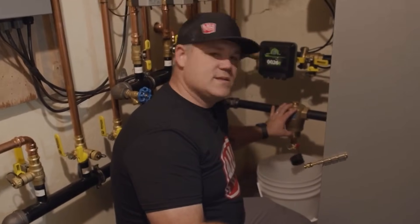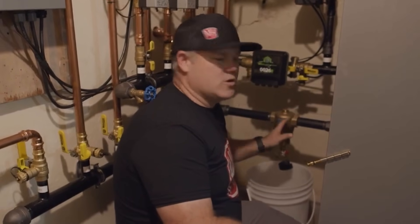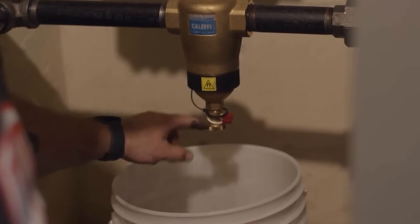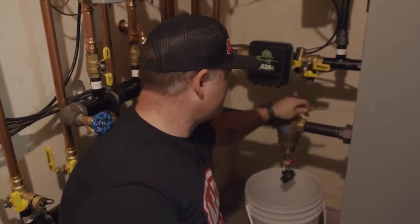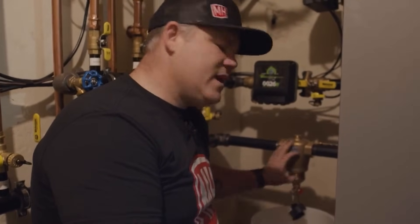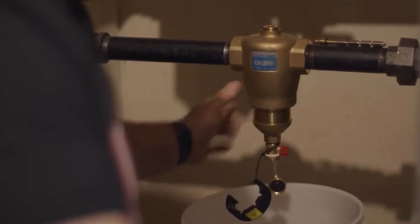What I've done is I've removed all the magnets. I've got the system turned off so we don't have water flowing through it, but I've got the makeup water on, so if I let a little bit of water out it's going to replace it and we won't have any problems with pressures. Right on the bottom of the separator is a hose connection with a valve. I've put my bucket here so we can see when I open this up the dirty water that's going to come out of it. Because remember, I removed that magnet — the magnet on the bottom is off. So any of the magnetic iron oxides, the particles that were collected on that magnetic rod inside, are now just sitting in the bottom. And as I flush water out of the valve, it's going to push them into my bucket. So I'm just going to open up the valve here.